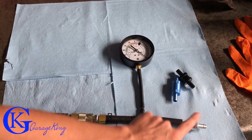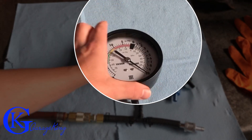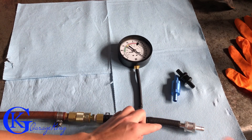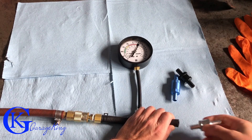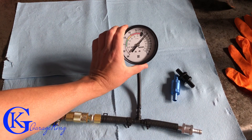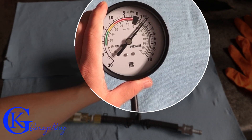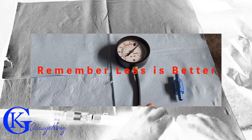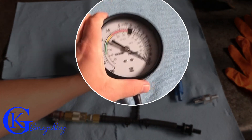Starting with the first valve, I put it in backwards so we can verify the one-way works - there's 10 pounds of pressure and nothing is coming out, so we know this valve works. Let's spin it around and see how much back pressure we have. We're at 2 psi, so it's providing a little bit of back pressure, but not a lot - 2 psi.